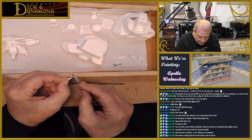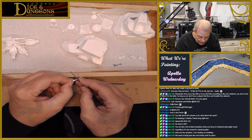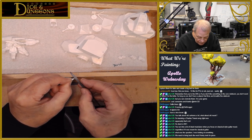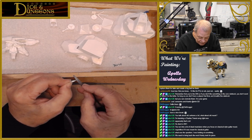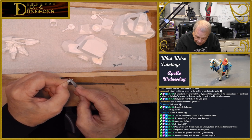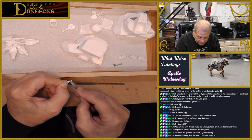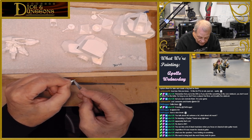This piece, I'm going to try to polish it with some sandpaper because it's going to be painted a fairly light metallic color. And the parts that I'm filing are going to have a different texture than the rest. So I've done this before when I've had to use a file to fix a part. I've rubbed the whole thing down with emery cloth or fine grained sandpaper, whichever one I happen to grab. And that way the surface texture is the same over it.